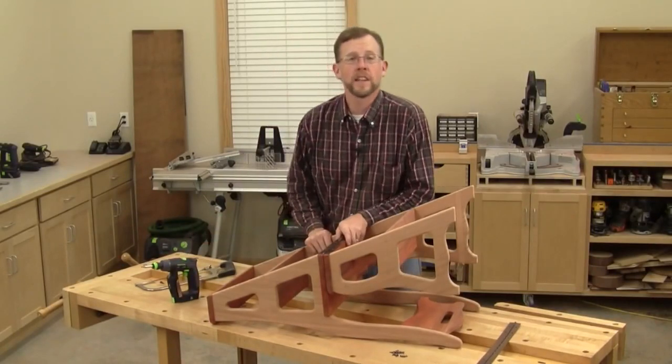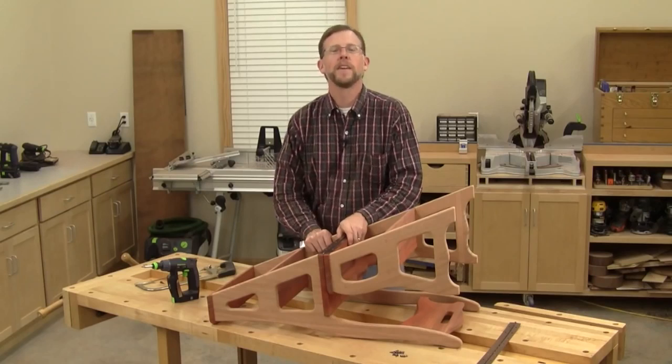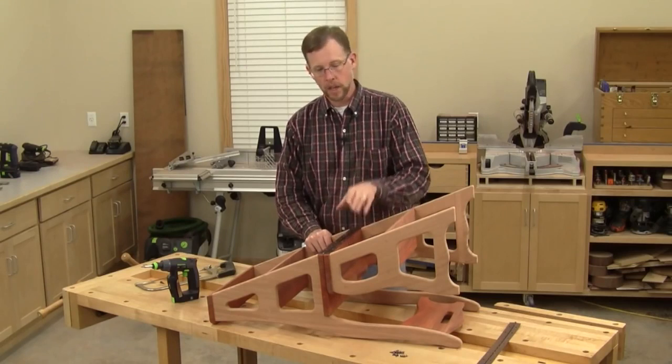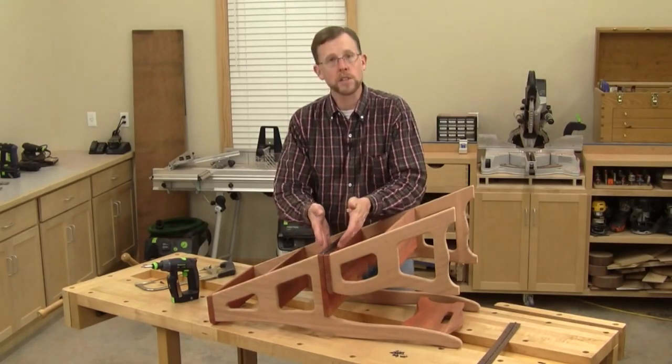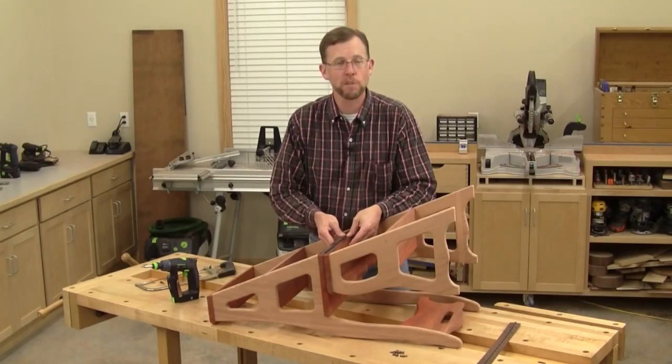With your wood plugs sanded flush, you're just about ready for finishing, but there's still one more step to do. Now is a good time to install the piano hinge and check the fit of the parts. Cut a 15" length of piano hinge and install it so the edges of the hinge leaves are flush with the top and bottom faces of the 2 seat boards.